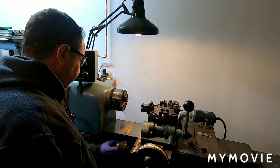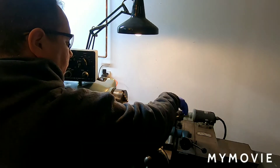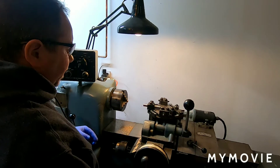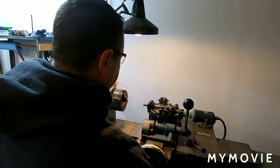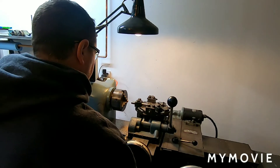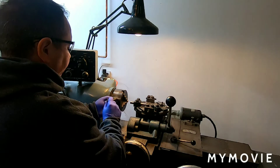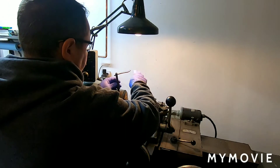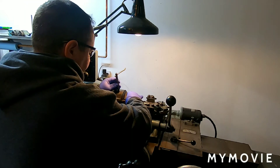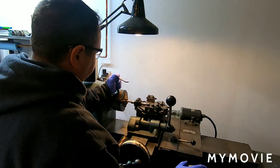Back to station one. If I had to call it, I just like having a three-jaw chuck — it's convenient to do more than one type of thing. You don't have to constantly change the collets out, so I like the three-jaw. But if it was a collet, it would definitely be faster. This part would definitely be faster with a collet.